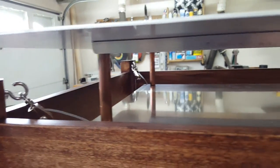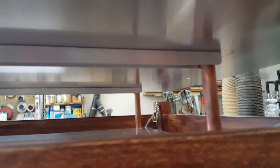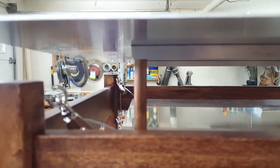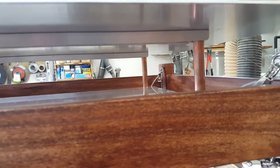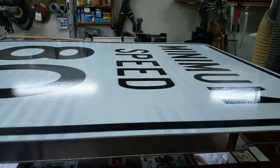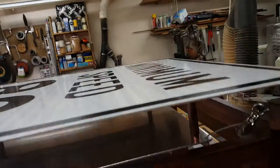One new thing I got to try out on this project that I'd read quite a bit about — you can see an aluminum channel attached to the bottom there. That aluminum channel is actually attached with 3M VHB, very high bond double-sided tape. It's interesting that it pretty much is the functional equivalent of a rivet, a bolt, or even TIG welding. So you can attach things without damaging — I didn't want to damage the sign side. There are no penetrations or holes up there. Amazing stuff.